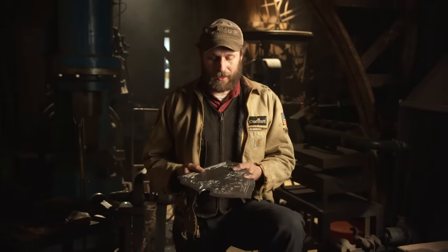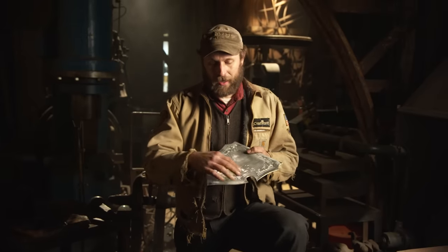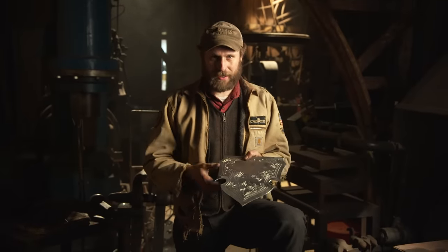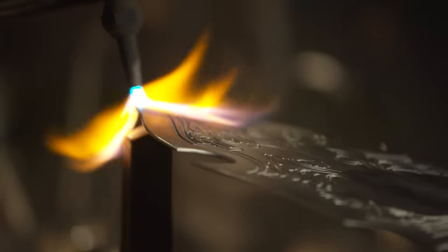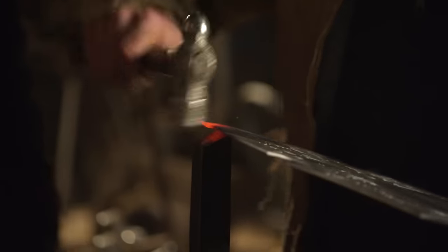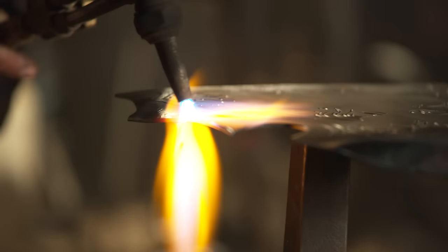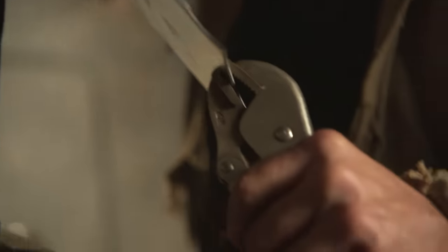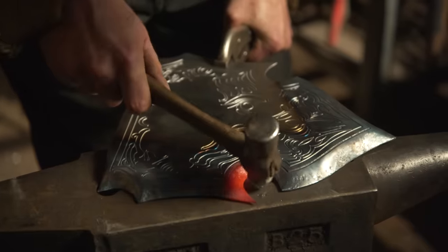Kerry and Tanner machined the shield that goes on the side of the axe. Derek takes it over a stake with a small hammer and creates height by folding it down like a bezel around the perimeter, which makes it look a lot better. Derek and Paul make it look pretty easy — it is not. Getting into those small sections with a real small radius on the edge of that shield is very difficult to get looking right, but these guys just knock it out.